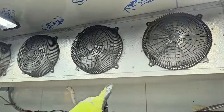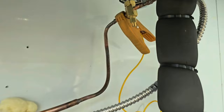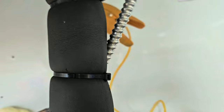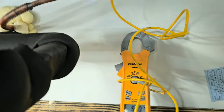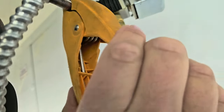This is the unit cooler. We've got the evaporator and we've got five fans. Here is the liquid line solenoid. We've got the coil on top, and I'm using my little pipe clamp to check one side. It says 57 degrees on this side.